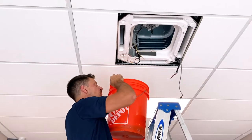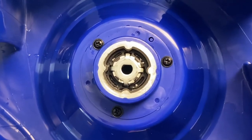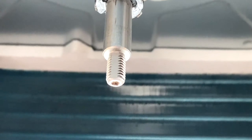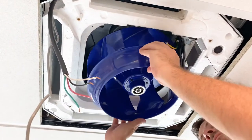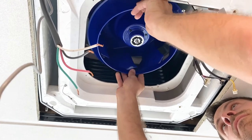Replace the plug before reassembling the unit. When replacing the fan blower, notice that the blower and attaching screw must align on the flat side. Slide the fan blower on, replace the washer and nut, and tighten with a wrench.